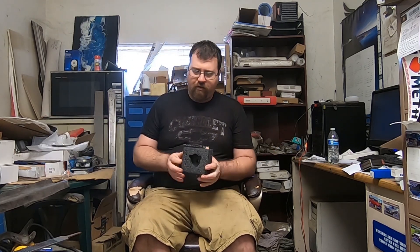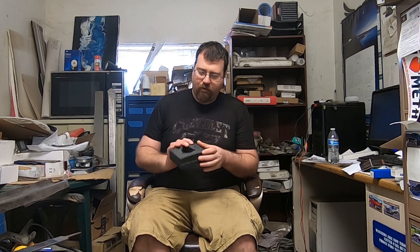When we did the packaging foam for the BNR valve, formerly known as the Booster Later, I actually paid someone to do it - it's made on a die that just punches these things out. On the Laminator we went straight to the laser, so we didn't have to buy an 800-dollar die plus like 500 pieces of foam to sit around. With the laser I can just cut the stuff as I need it. Cost-wise, if you take out that 800 for the die, the cost is about the same versus having someone else make it, but you don't have to buy 500 pieces or have a die made.